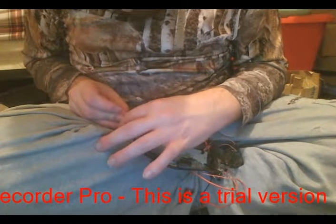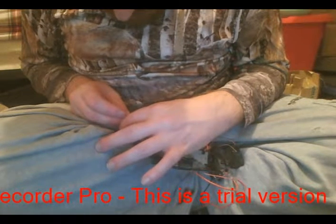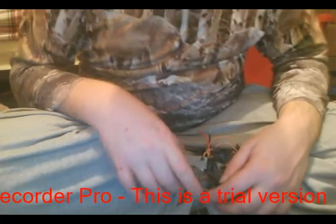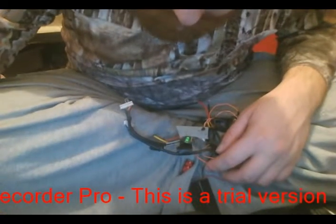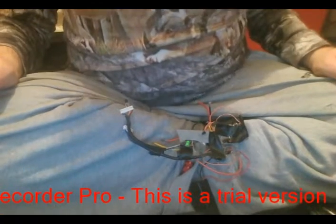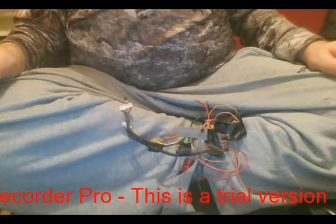Let's watch. I think it should go faster, I think, if I remember right. As you see now, if you look at it, you can see that it's flickering, but it's flickering faster. And that tells us that we reversed the collector and emitter. Because you can't reverse the base. The base is a different polarity than the other two. Current won't flow.